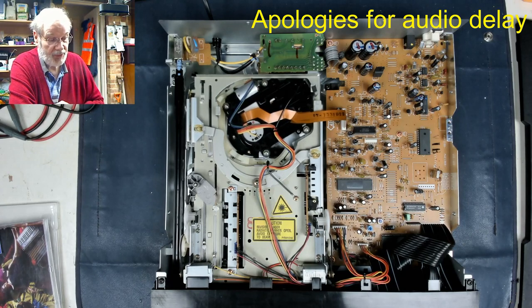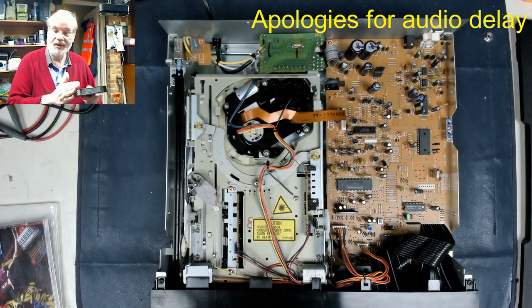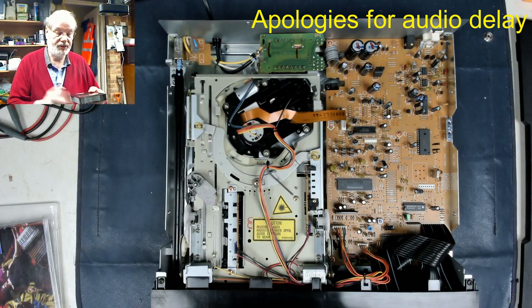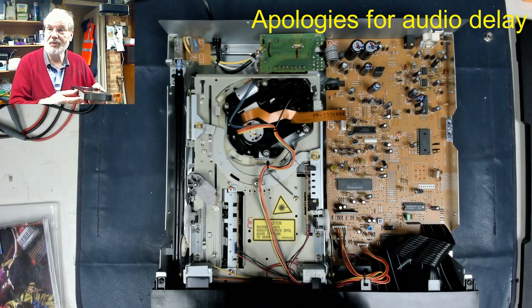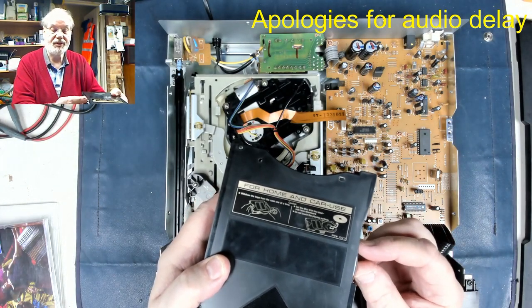So usually if you press eject, it ejects the cartridge, presumably with this held in there, and the mechanism then rises back to the top, because it always tries and looks at this one first. One of the problems that we used to get with this is the disc would sometimes just not quite sit properly in the tray, but the customer would still ram it home like that, and it wouldn't drop into the right position. So you end up with a disc jammed in there.